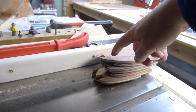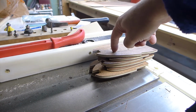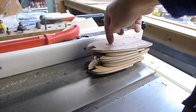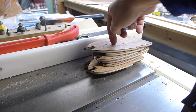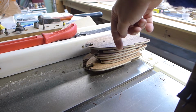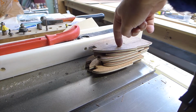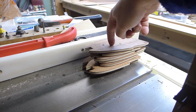I've got a pile of these that are cut with one angle here, and a pile that are cut with the opposite angle. So now it's important to make sure that this pile gets the correct angle cut here and here for those smaller slots for the aluminum angle. And the other pile gets the opposite angle. One of the tricks will be cutting this one at the right angle, then I'll flip the jig over to cut this one, and I'll need to make sure that it's going at the same angle as this one. And both of those then will be opposite on the other pile as far as how the jig is set up. So I need to be very, very careful about that so I don't ruin these nose ribs.